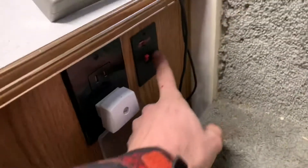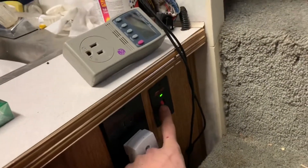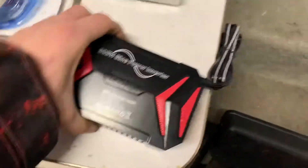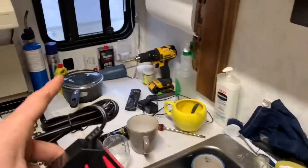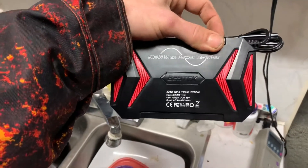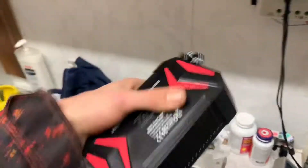The only thing that isn't on that is I have a 1500-watt modified sine wave that goes to this plug — that's the switch for it. This one's directly on the battery, and same with the one over there behind Kiki. This is the one I just got today. All of the outlets in the trailer are going to be hooked up to this one here, because it's 300 watts and my average load won't really be more than 200 — it can spike up to 750. And this one's pure sine wave, but I need to get a light in here.